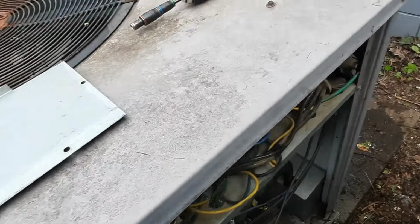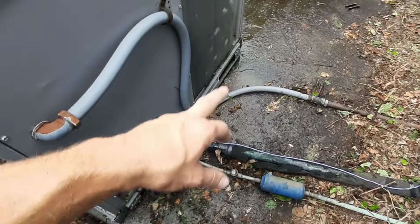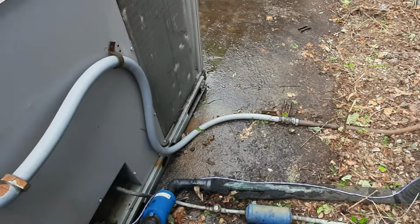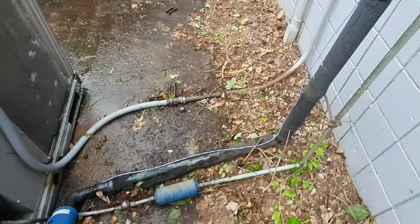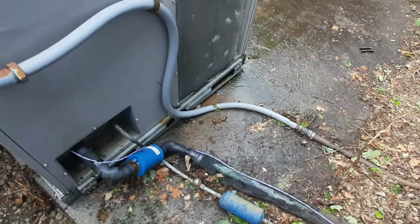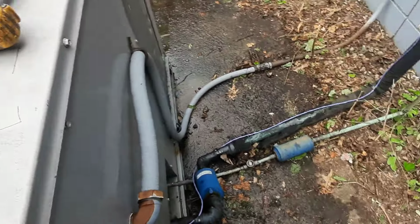There's my new one. I'm gonna put it in the same spot. Sight glass was bubbling again. I noted it. The condenser coil wasn't that dirty. I thought maybe it was because of that and the high load when I first turned it on. I'm not gonna add anything today. I'm just gonna note it so they know what they got, and we can kind of go from there.